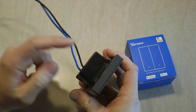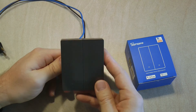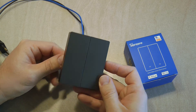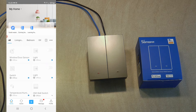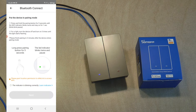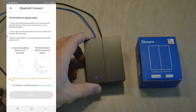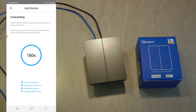With the protective cover on, you can't easily touch the terminals, so you're protected from electrical shock — but of course you should always turn off your mains power before disassembling anything behind your switch. I have this unit hooked up to the mains now. In the app I click the plus button and select Bluetooth pairing, then validate that the indicators are flashing — blue on one and red on the other — and search for the device. I press Connect, provide my Wi-Fi name and password.